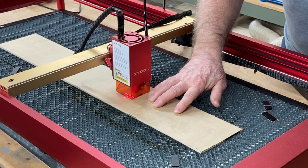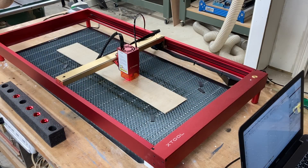That's how simple the setup is to get ready to carve. This lets me set projects up very easily and quickly without taking a lot of time. Is this a process for everybody? Probably not. But when I first started with lasers, I never homed the machines — I always used this method. Since using the X-Tool and other lasers I have homed them, but quite frankly it's just about as easy to use the current position, drop the material onto the laser bed, line it to the center point, do the framing, and start cutting. It has worked out extremely well. The framing is nice because it shows you exactly where the project is going to be cutting, and if you need to adjust it, you easily can. Once everything is placed where you want it, just hit frame.